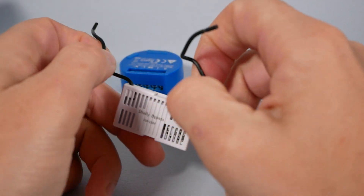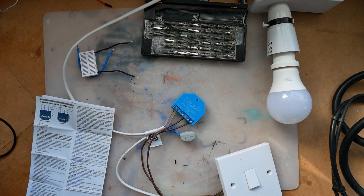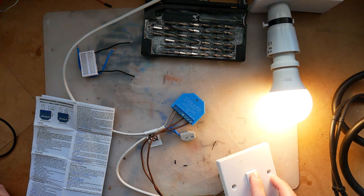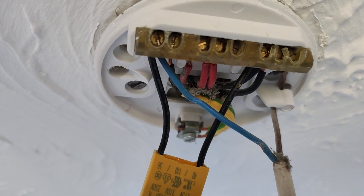There is a solution called Shelly Bypass — a small device that allows the relay to function with low-powered light bulbs. If the bulb you're trying to power is less than 20 watts, you can use the Shelly Bypass, which costs about two and a half euros extra. If you attempt to connect the Shelly to a single bulb drawing less than 20 watts without it, you'll notice instant flickering that will cause Shelly to reset. This bypass works similarly to a smoothing capacitor, but I strongly recommend using the designated bypass device with Shelly 1L.